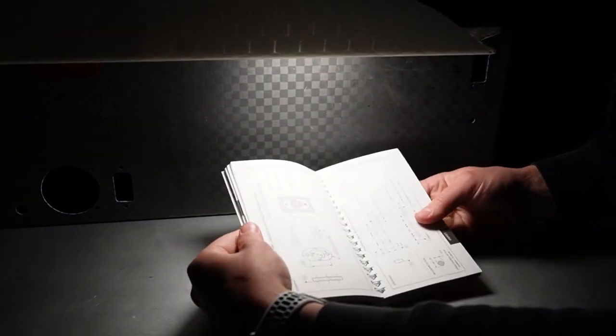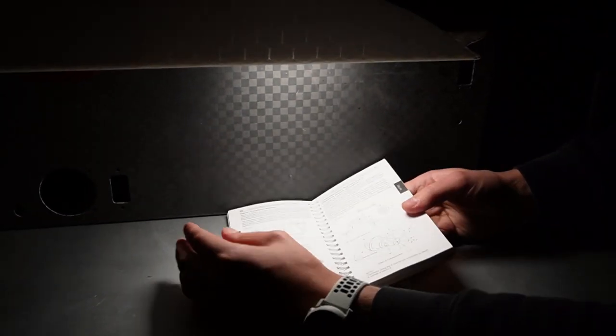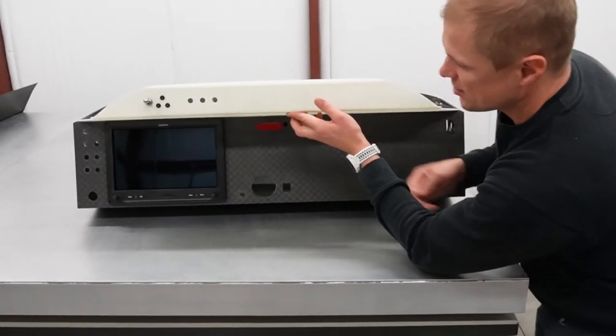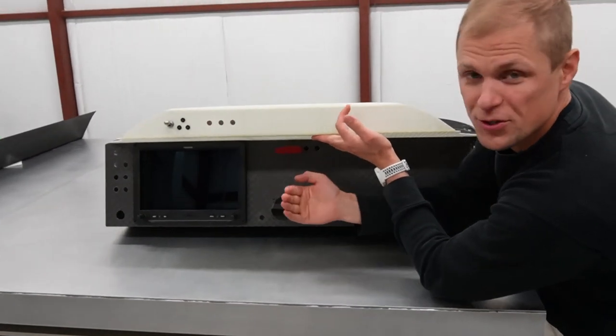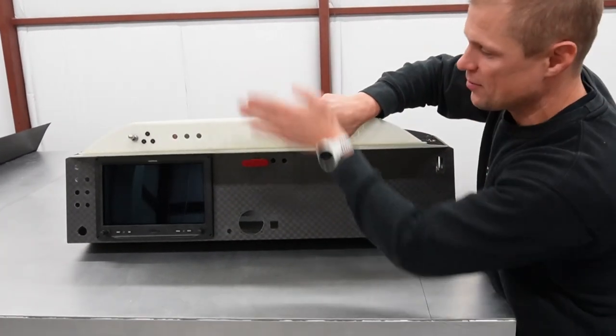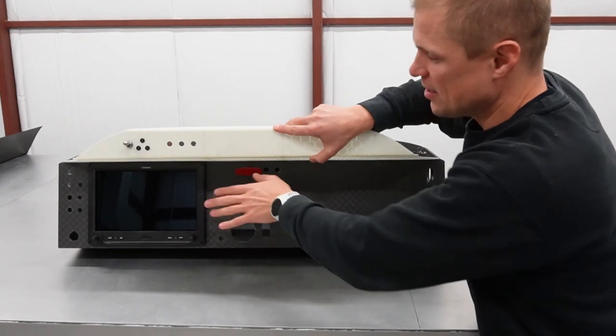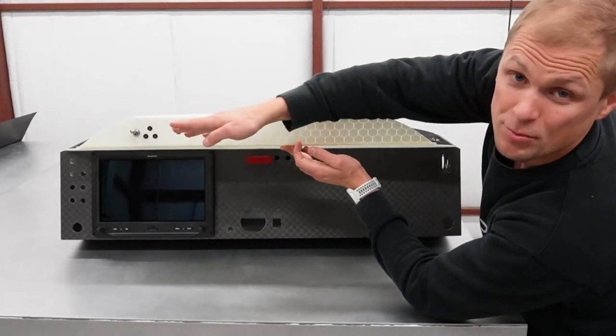We'll kill the lights to show that. I have a red light here that would act as your map light — at night when you don't want to mess with your night vision, you use red light to read your map. Or if you need a little more light, you could have a white light back here. You can really light up the cockpit that way. A couple of other things: the way the panel sits in the aircraft is tilted so it's normal to your line of vision. In a lot of light aircraft the panel is perpendicular to the ground, which makes it inclined relative to your field of view. We have it tilted up a little, and the glare shield is also angled so it doesn't block any of the instruments.